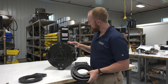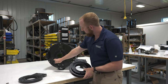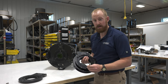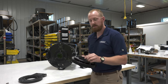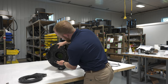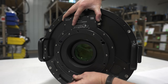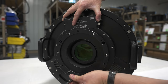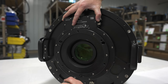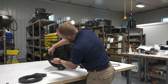Let's go ahead and install the focuser onto the back plate of the Delta Rho telescope. You have the mounting holes here and we're going to use our 5/16-18 TPI bolts. These bolts are three-quarter inch long for the focuser and we're going to install it onto the back plate. One screw is in — we're going to go around and install the other two screws.